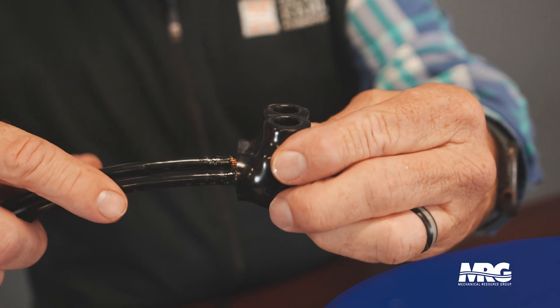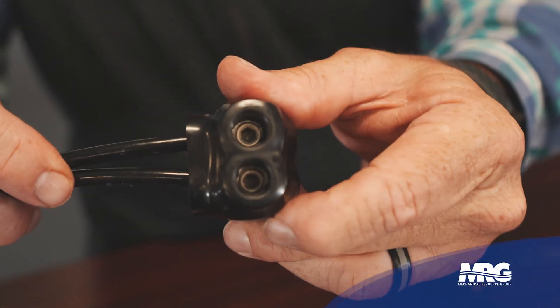Not too long ago, a company called Polaris — Ideal makes them now — created an insulated lug that requires no rubber tape or black 33. You put one wire in one side and one wire in the other side, and there are hex head connection screws on the top. You run those down and your two wires are mated together. This is an acceptable method per NFPA 79. The problem is it's very large and hard to get inside the motor terminal box, but it's a very good connector.